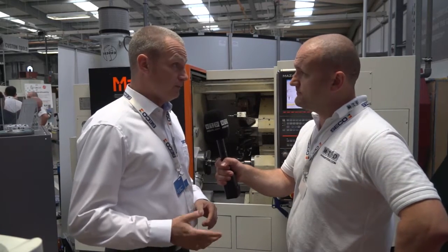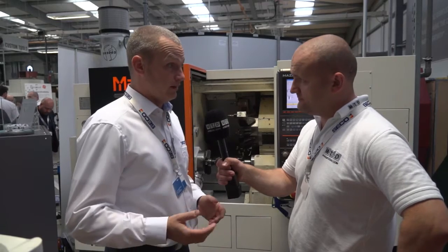It's pretty straightforward. It's a case hardened steel, 58 to 60 Rockwell, and we're going to use CBN inserts for producing a nice and perfect surface finish. So no coolant, no carbide? No.